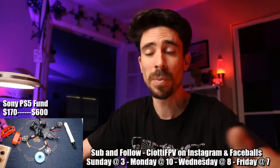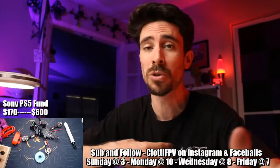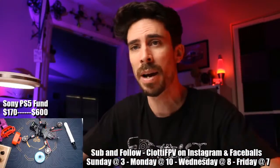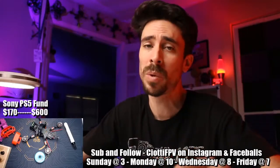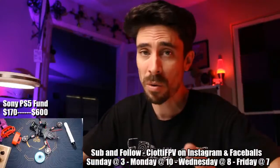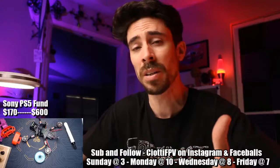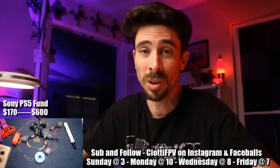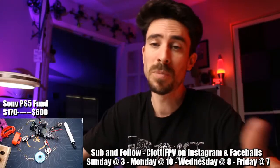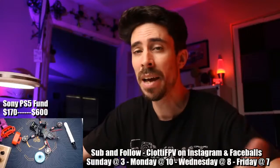But yeah, there are people that prefer 12 to 1. There's people that prefer 8 to 1. I'm closer to the 8 to 1 crowd, 7 to 1 crowd. The less power that you have, the more throttle resolution that you have. And the more throttle resolution that you have, the easier it is to fly the rig and the more accurately you're going to be able to fly it. And that's what I want. I want my flight footage to look good so that you guys enjoy it. So the least amount of power is one of the ways that you can do that.